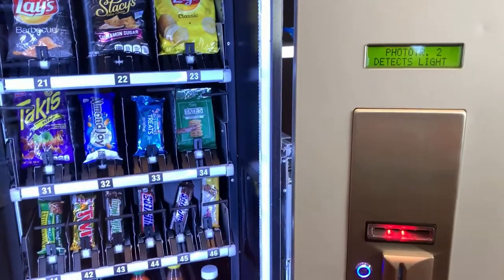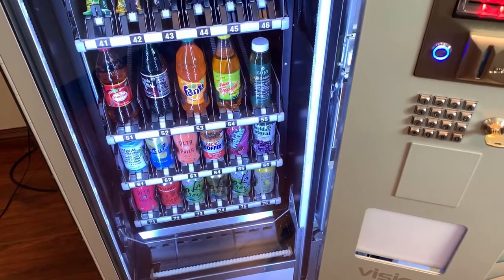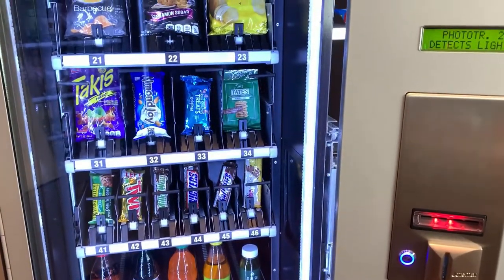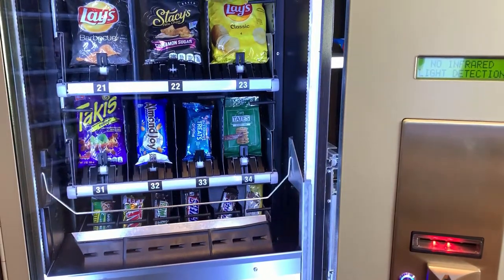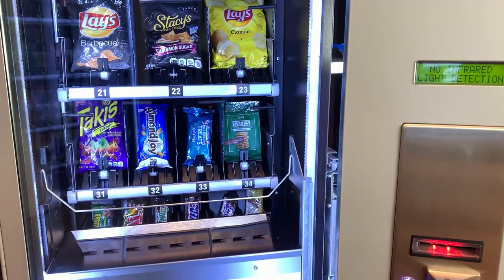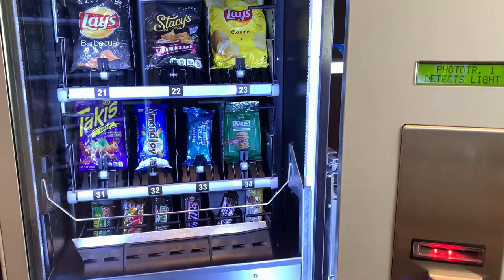Since the elevator is at the bottom, it should be detecting the bottom sensor. Now we're going to move the elevator up by pressing and holding number one until we reach the middle sensor. Right now it's detecting the delivery beam position sensor, with an indication shown on that end. The cabinet sensors are working correctly.